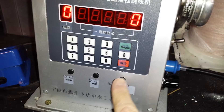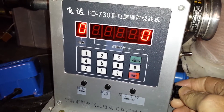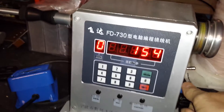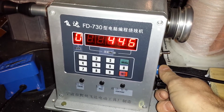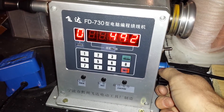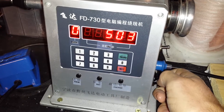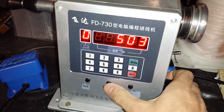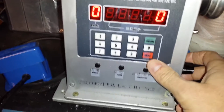This is the start or pause button. Press start, then turn the dial up. When you're getting near the end of your winding you can dial the speed back down to zero if you have a spare hand. I'll just hit pause, then reset — you can hear the relay click — and that resets the counter.